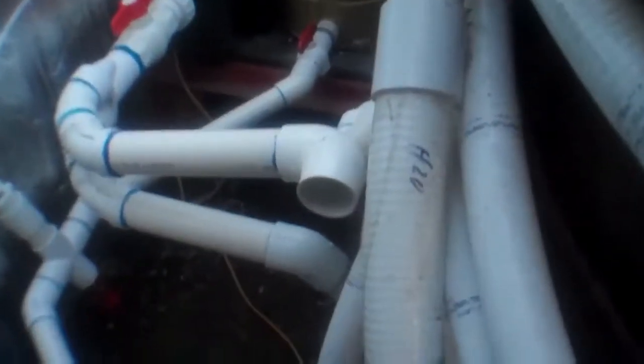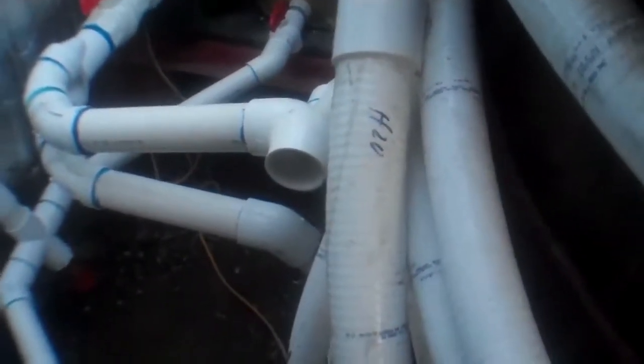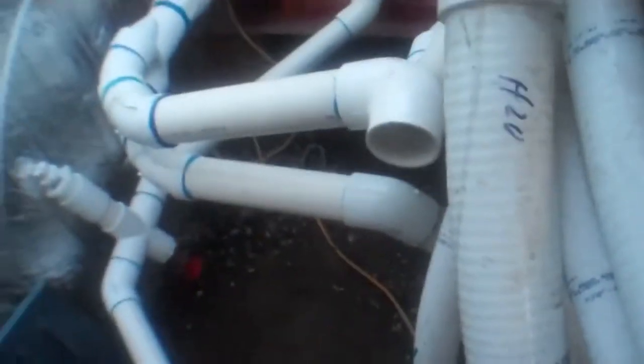The reason for splitting it is: if somebody's hair got caught in the skimmer strainer, it's going to suck the rest of the water from the bottom so it won't lock you to the wall. Many kids have drowned that way. So in any hot tub I do, there are other strainer intakes — there's one in the middle — so if one gets plugged with somebody's hair and a kid gets sucked against it, all they've got to do is pull away, because it's drawing from the other one too. There's no chance of a vacuum lock.